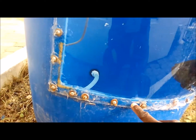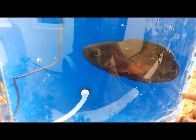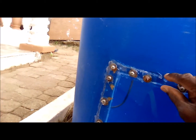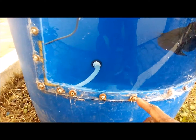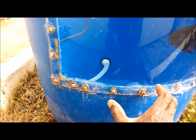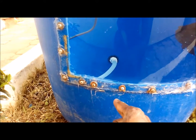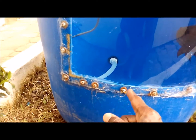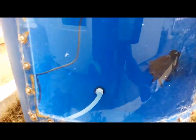How I will address the rust issue — I will be purchasing primer spray. I will cover the area with paper and then spray about half an inch of this primer on the outside and on the inside. Similar to when you paint a grill, it will sit on the screw and prevent the oxygen in the air from oxidizing with the iron in the metal. I found it very difficult to actually get screws that were rust-proof.